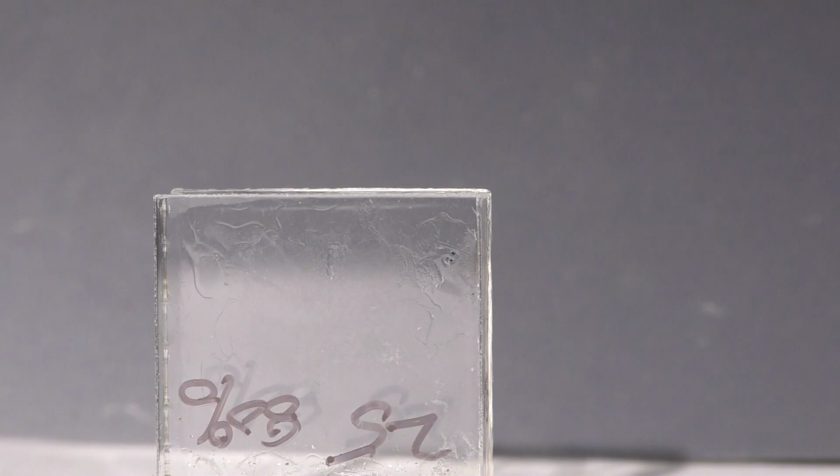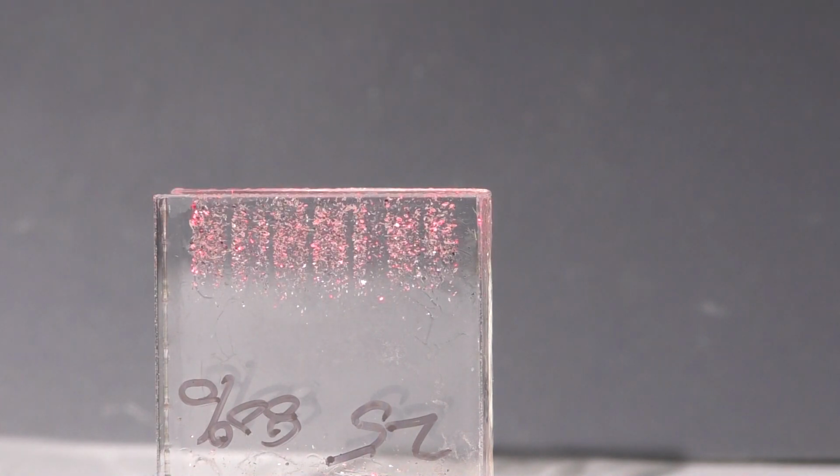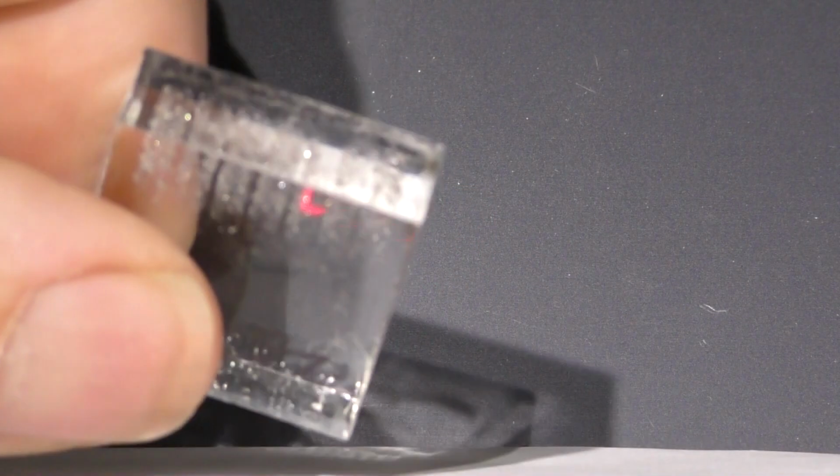Running slower puts more pulses into the job. So let's reduce it from 1500 to 1000. And now we probably will expect to find more bubbles or more shear planes and more crackling and popping. Well, we're running slower and it probably looks as though we've got a greater density without actually causing too much more physical damage. Yeah, I mean, it's down below the surface.